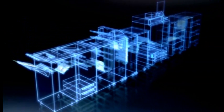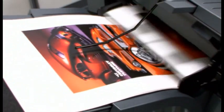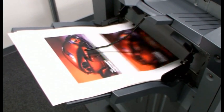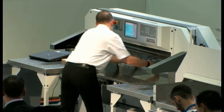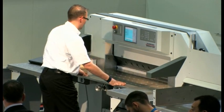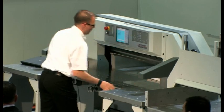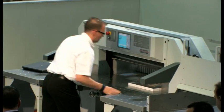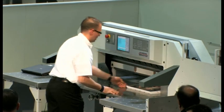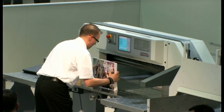The CMS Dunet Zone is where you'll find the Imprimia C80 digital printing machine. The C80 is capable of outputting 80 A4 sheets a minute, single-sided, and it can easily handle thin sheets of standard coated paper. But this system is all about bringing together offset and digital technology. The key technology behind this is colour matching using Komori's K-Colour Simulator, which allows the POD machine to output the same colour as the offset press. The biggest feature of the K-Colour Simulator is that it makes specialist colour management expertise unnecessary, enabling easy and accurate colour matching.